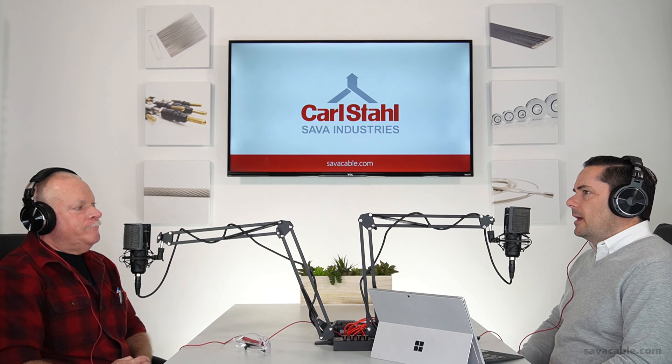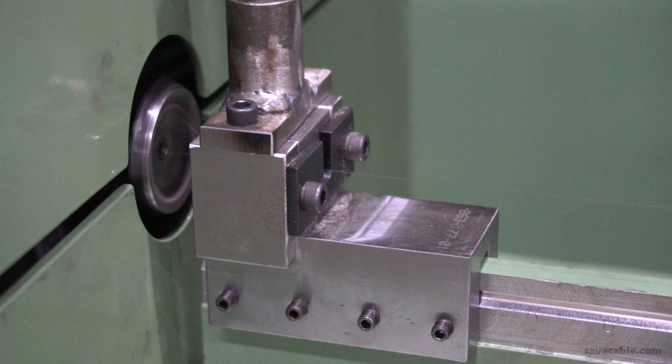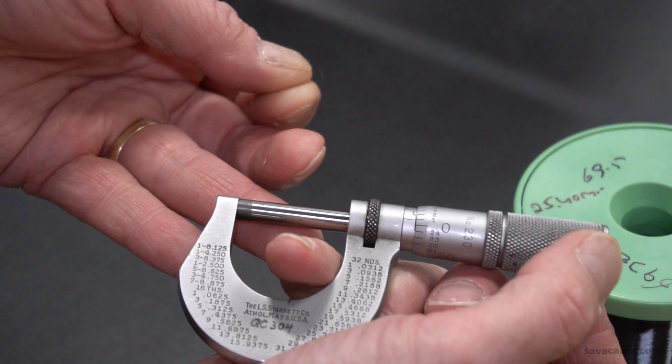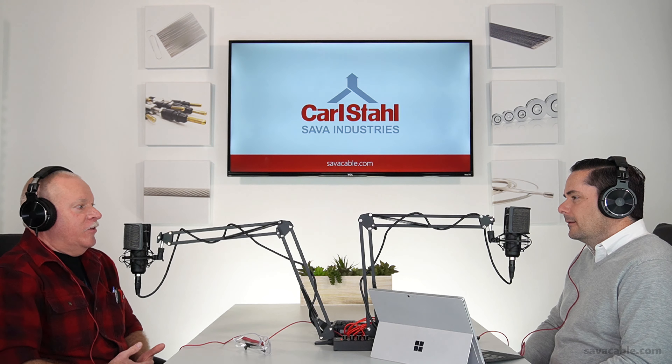What are the typical sizes of our cable? And for those of us who are not mathematicians, share how small it gets by comparing it to something we'd all understand. Our basic cable line starts out with wire as small as double-O-one-two. So that dimension would be: if you took one inch and broke it down into a thousand separate units, that would actually be just a little larger than one of those units — that particular wire. That's our basic. It's almost impossible to see — you're talking human hair. A human hair is probably two or three thousandths diameter, so you're talking about wire that's half the diameter of a human hair.